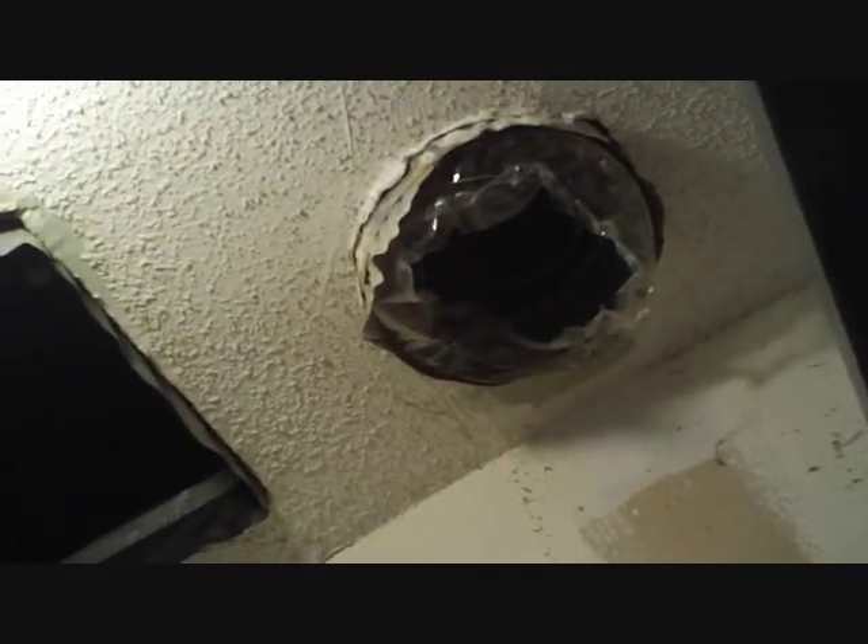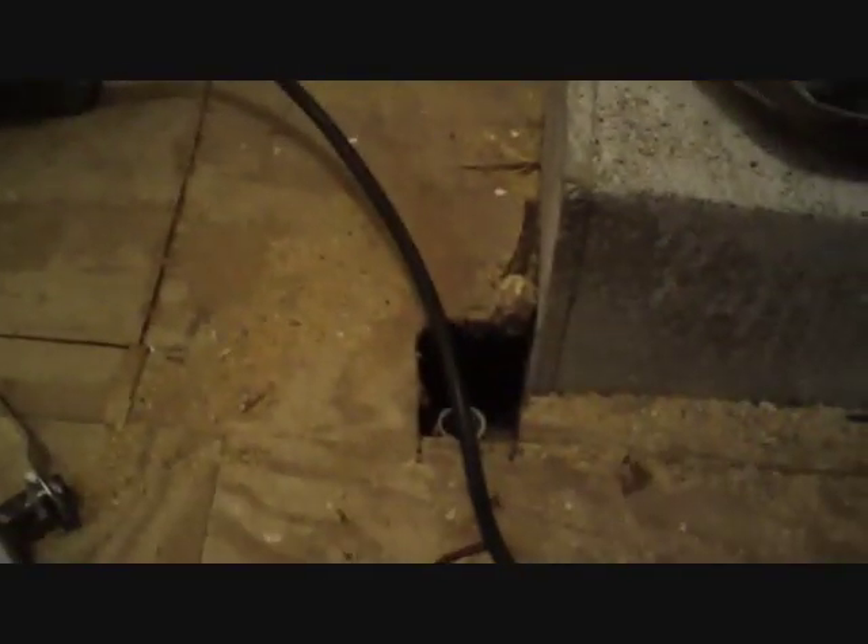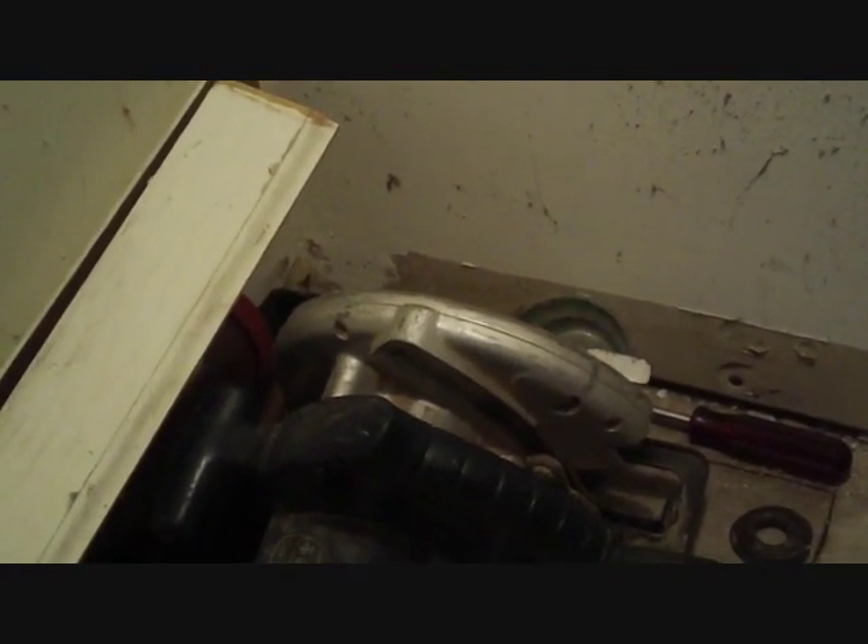Went ahead and cut the moldings off with the Harbor Freight oscillating tool, which is fantastic. Cut these moldings off so the drain pan can slide as far back as possible, because there's a finite amount of space. You have your supply on there — the old one, which I'm going to cap off and use as the entrance of the supply plenum. Since we've got two zones, I want to even it out a little bit. Before, one zone was getting all the air and this little branch zone coming back down wasn't getting anything. I looked inside and it's an old pressure plenum line box with four runouts on it. The plenum looks still good, so I'm going to use that. We're going to keep chopping away at this, but I think we've got the layout sort of ironed out.